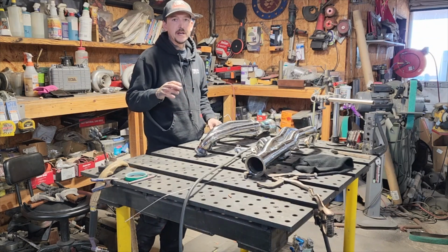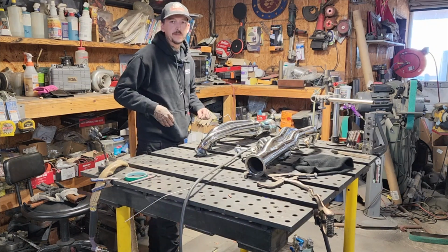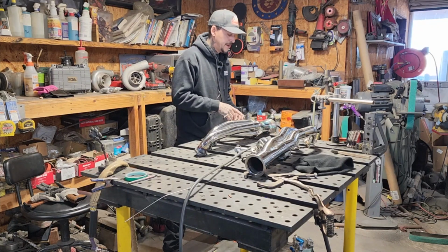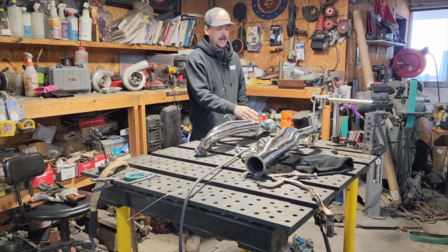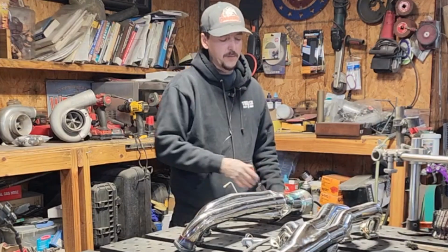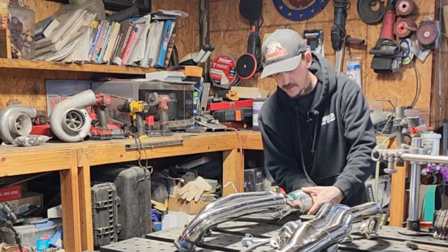I've owned a lot of different back purge kits and cones and things like that. I've had some 3D printed ones that I ended up accidentally breaking one of them. But what I've got here is just a conical reducer. It's, I think, 1.5 inches all the way up to a 3.5 inch conical reducer with an end cap welded on it. And I've got a quick connect fitting on the end of it to run my argon through.